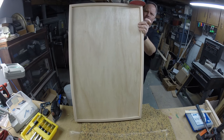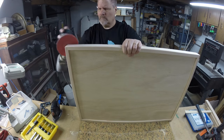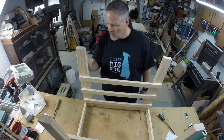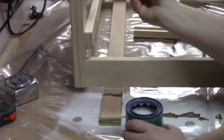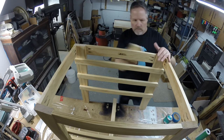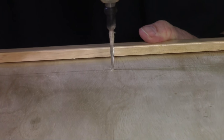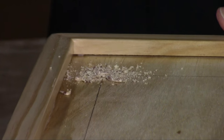The next day I removed the clamps and sanded all of the edge banding, being sure to ease the corners. To prepare for the finish, I cleaned off the sanding dust with a tack cloth while Becca vacuumed the floor. While I cleaned off the base, Becca got started on the finish — a clear, non-toxic polyurethane. It was nice having a helper to do the first coat. Then I did a light sanding and two more top coats. After everything was dry, I marked lines on the top where I would screw it to the base, drilled eight pilot holes on the lines and countersunk the head slightly, then screwed the top to the base with two inch screws.